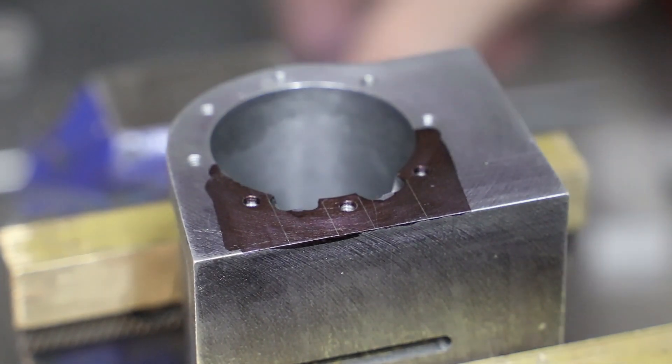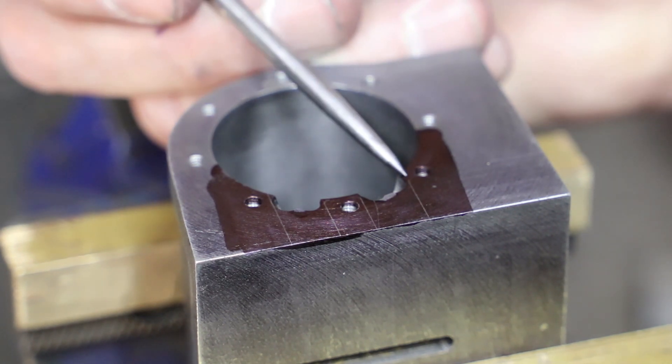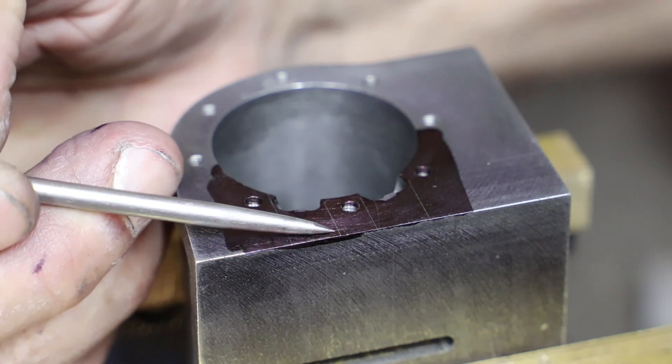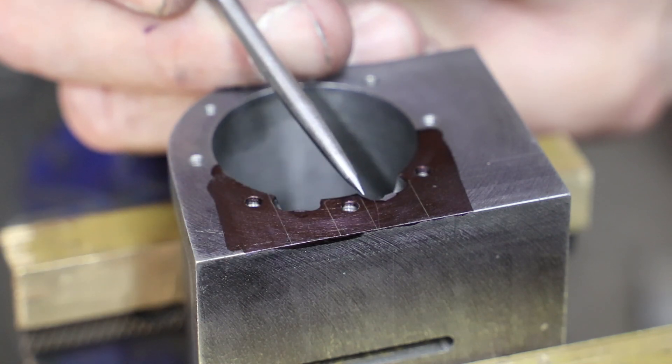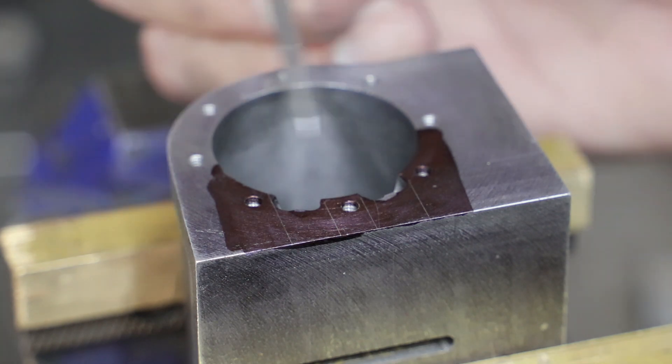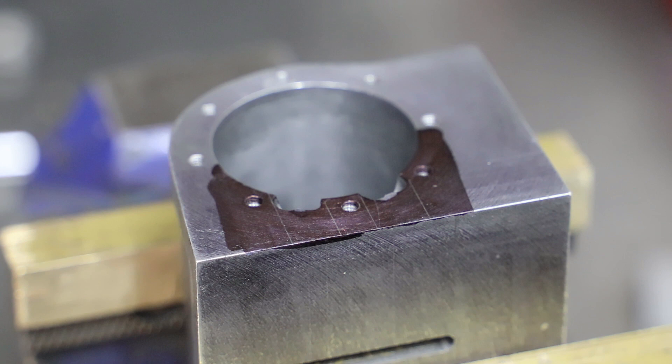Whilst drilling and tapping the holes to the covers I did notice another mistake. You can see where the steam passages start in the circumference of the bore, and if we look at each of these with respect to the top center hole, the right-hand passage is much closer to that bolt hole. As the bolt holes were drilled and tapped correctly relative to the cover and bore, it means the steam passage on the right is not positioned correctly - the same applies to the other end and to the other cylinder block, so it's a systematic error. When I make mistakes it's normally down to rushing, not paying enough attention, or not planning ahead. Due to the systematic nature of this one, I think it's more about an over-reliance on the DRO and not enough focus on the workpiece. I don't think this is going to be an issue - it was already very tight in this area and it's now a little bit tighter.